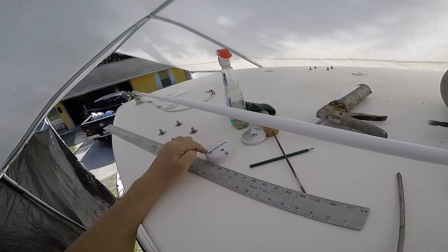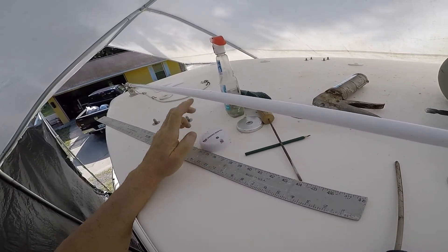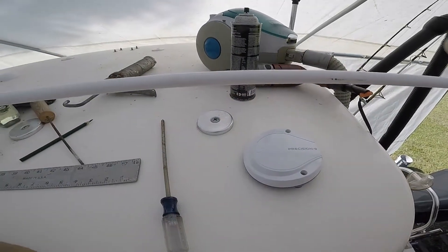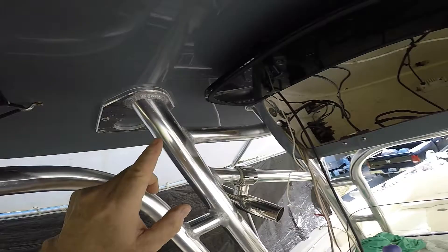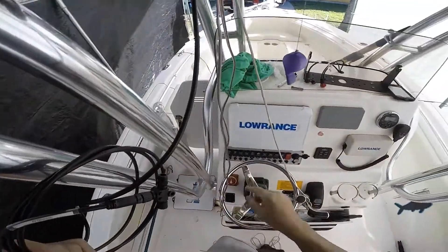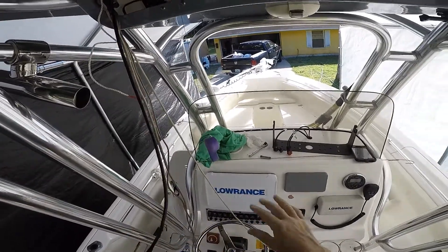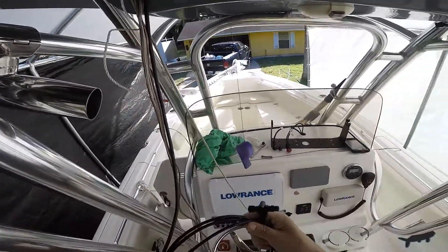These GPS units — you do them the same way. You face them forward in the direction they tell you, put your holes, run your wire down through there — it's the same thing. So this is our compass mounted and we're done with that. I ran the wire through the tube as explained earlier and came out in the electronics box. Now we run down through the pipe all the way into the console. I have my NMEA 2000 grid down there — this is going to go into the NMEA 2000 network. All your electronics are hooked into that and they all talk to one another.